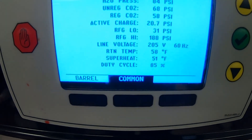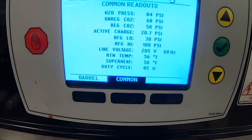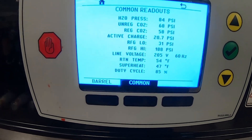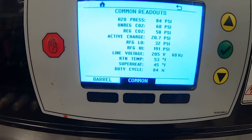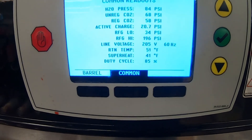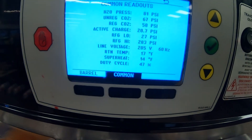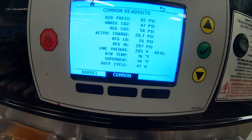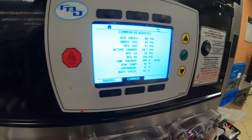Okay, it's running — our pressure right now is reading 188. This has a remote condensing unit which is on the roof. Right now the head pressure is nowhere near where it should have tripped off. We'll continue to monitor that. As we let it run, the head pressure has shot up to 285–287, so we may need to get up on the roof and check that condensing unit.